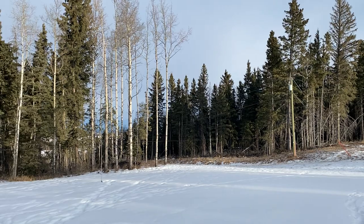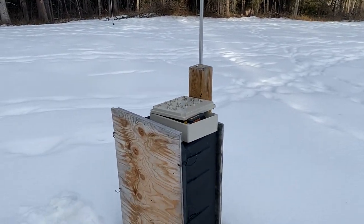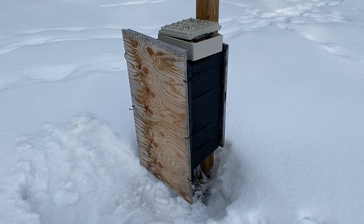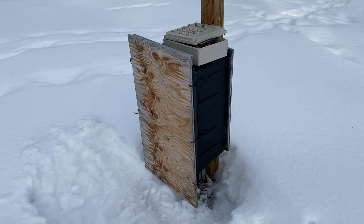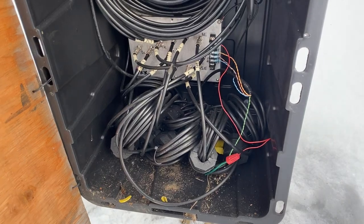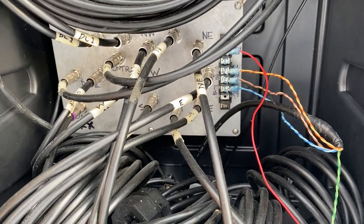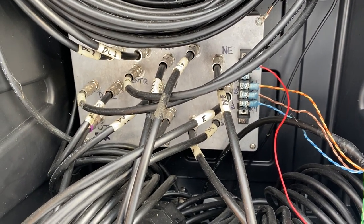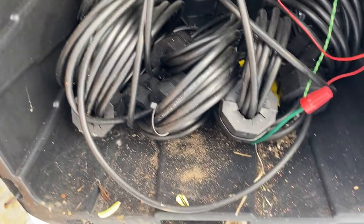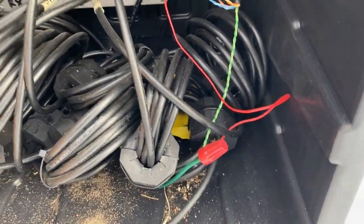It's a fairly mild day today out at the remote. I'm going to install the new nine circle combiner box. This is my large containment box that I got from a home building store — I had to replace the lid because a moose chewed the plastic top off of it. Here's the current installation with the existing combiner box, which has an integrated 2N5109 amplifier. I won't have that on my new box. The idea of the new box is to eliminate all these clamp-on type 31 toroids.